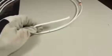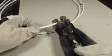This lug here is going to attach to a 5-foot length of 8-gauge cable. This was left over from when we wound our coils. We'll just need to strip about 2 inches of insulation from the ends to expose the copper wire, then bend the wire over with a pair of pliers to form a little loop.